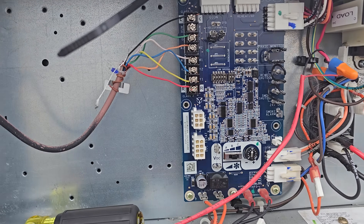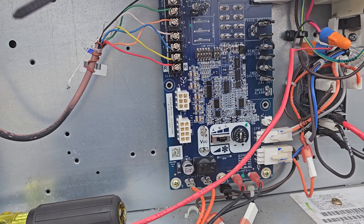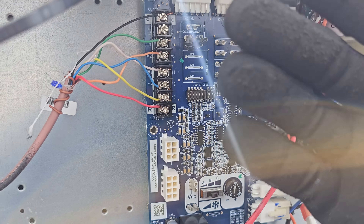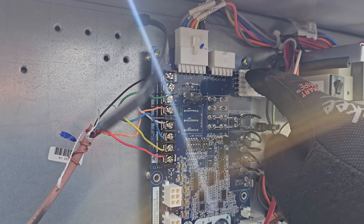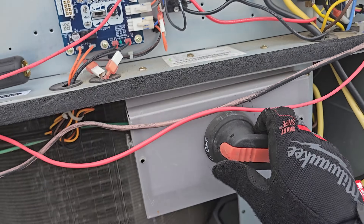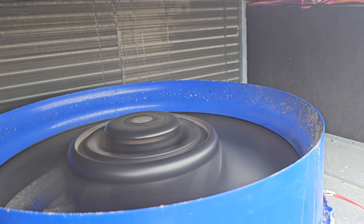It's back in one piece. I had the board out because I was troubleshooting on the board itself to figure out what's in between - any interruptions between where the 24 volts comes in at terminal one on the main plug and where it comes out to go to the thermostat. I needed to get access to all the pins, so I had to pull it out to get my test leads on there. I'm going to power this thing up right now - the light is lit, the fan is starting up. We're good to go.